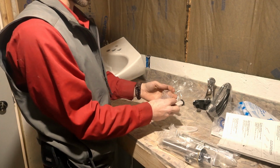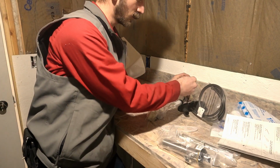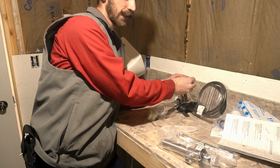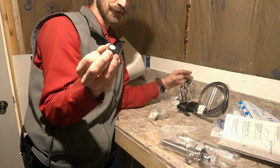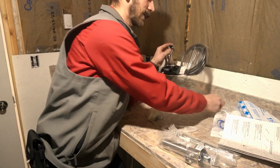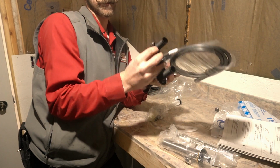And even right away, just so I don't forget, when you go and fill these up, a lot of times you've jostled pipes loose, you've made sediment come loose, so you want to take the aerator off of your faucets. I did already take it off another faucet in this room on this system because it's got that screen in there and that'll get all clogged up. But it can free flow, get all the sediment out down the drain, and then you put this back in later. This tool is required for these ones, but they're nice because they got a little clip on there that snaps in there.